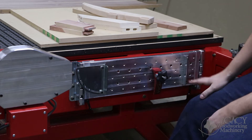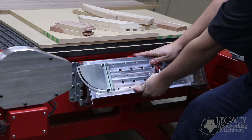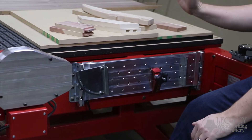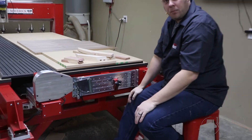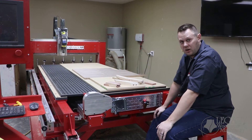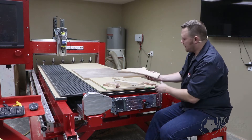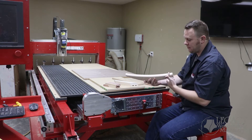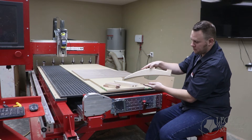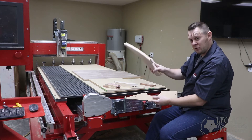The other type of fence we can apply here is the entire aluminum plate itself. If I loosen up these two nuts on the bottom, I can actually angle that from zero to 90 degrees as well, giving us an angled plane along the x-axis and along the y-axis. By combining both, we can produce compound angle joints, which is a very versatile capability. There are also custom fences for non-straight-edge parts — for example, I have this stool leg with a curved edge, and I used the CNC to cut out an MDF fence that fits it perfectly, giving access to surfaces parallel to the machine. Those are sliding dovetails as an example.